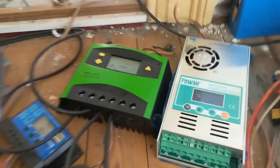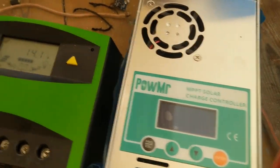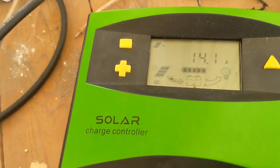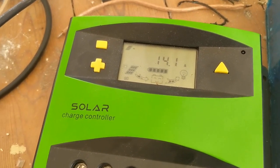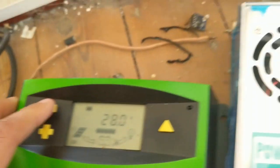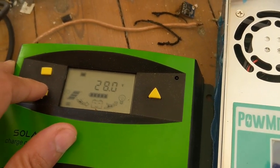With so many amps, the voltage drop on the cables will be 2–3 volts, putting me no longer at the battery voltage. That's why I bought two of these step-down units — I'll upgrade to a 48-volt system, take three solar panels in series, step the voltage down, and it will be fine. Right now in full sun we're seeing 14 amps at 28 volts, which is roughly 400–500 watts. I have 1,200 watts installed and it's November, cold weather — output should be higher, so that's something to investigate.